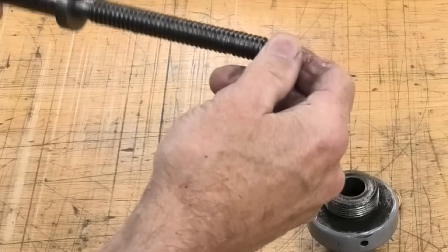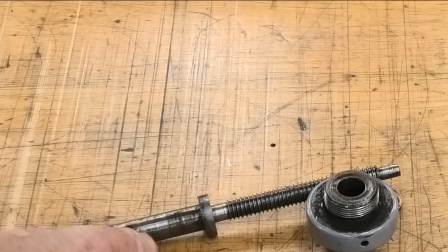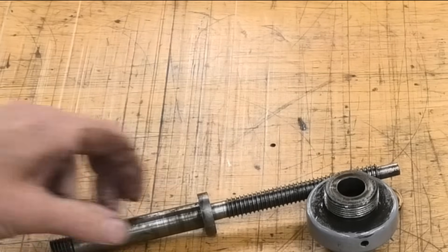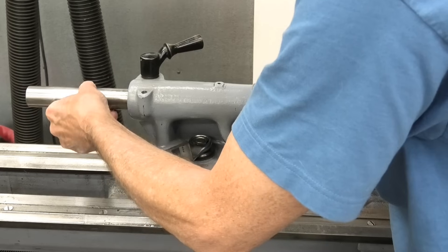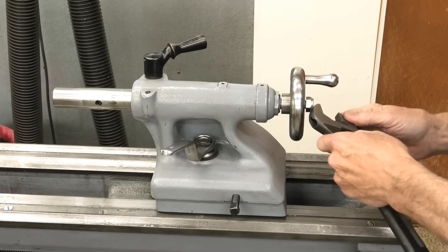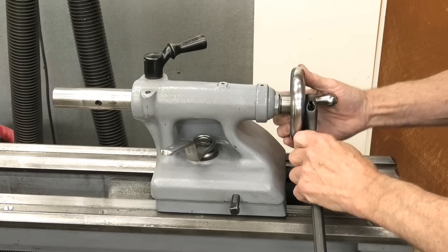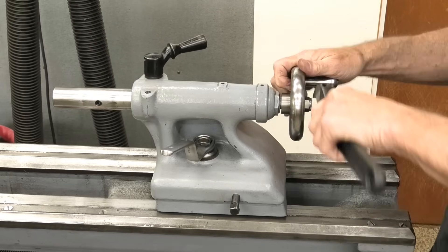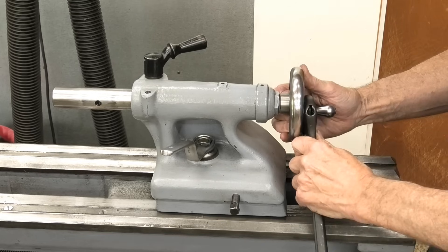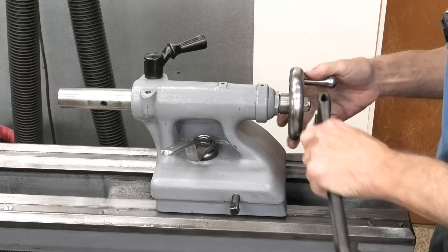The tool I used to make those threads I made myself out of high speed steel. Plus this was trying to flex when I was cutting it. Hopefully it'll go better this time. I'm going to draw that off camera so I've got something to go by, and then I'll put the tailstock back together so we can support this piece when we're making it. At the time I did this the first time, I had this lathe and my Logan A20, so I actually fabricated the ram on the Logan A20. It had less wear than this lathe, but this one's a little bit more solid. It'll go better because I've got a follow rest.